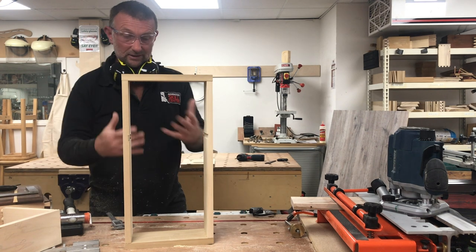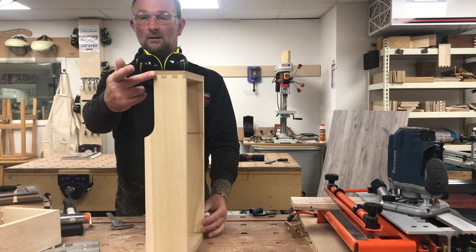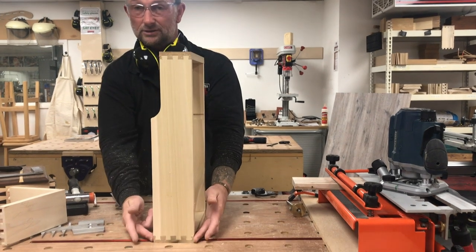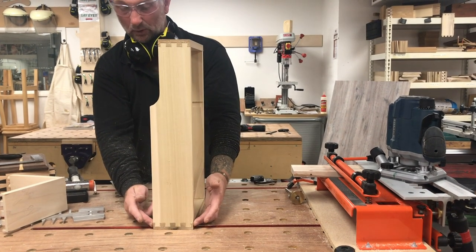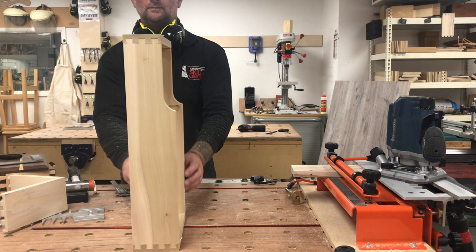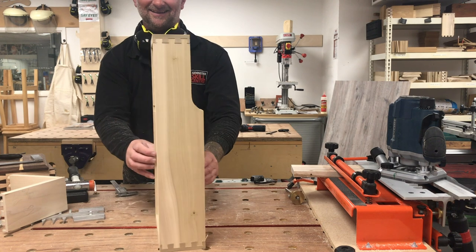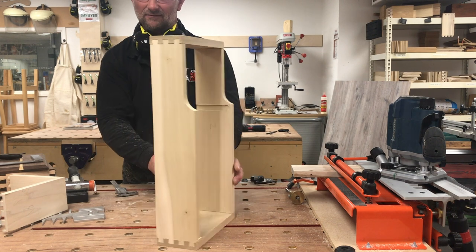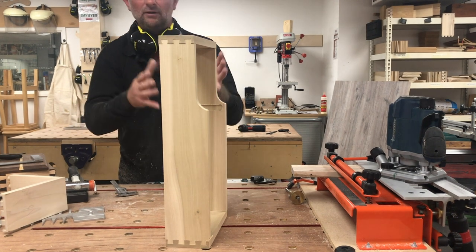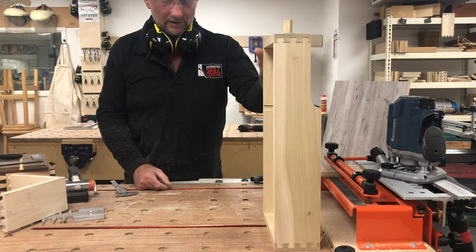So if your material's square and your setup's right, there we are. 3-inch lapped half blind dovetails, 4-inch lapped half blind dovetails, a splodge of glue and a little bit of sanding. It's sweet. Look at that. See that? Exactly. Really effective and quite easy to master as long as you get those keys right. That 11 mil. Everything's flat and level. Everything's square. So that's a half blind or lap dovetail.